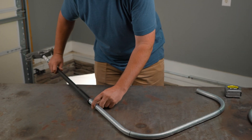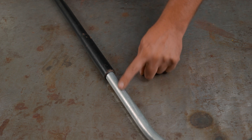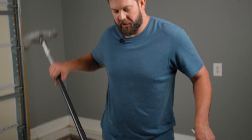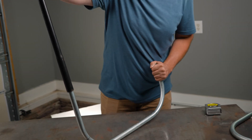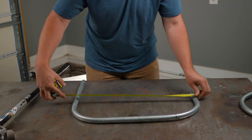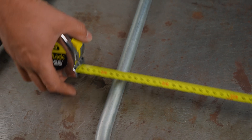One cool trick: I overbent this angle — you can see it's a little bit past 90 degrees. In this bender, and a lot of benders, you've got a really cool trick where you can insert the conduit that you overbent into the handle. You can see it's flared out there to go over the conduit, and then it gives you a long handle to apply leverage and get that back to where you want it. It's really easy to adjust it off, and now we're back to that measurement and really close to that 24 inch distance we want. That's extremely helpful if you're trying to do a table leg or some other U-shaped bend — you're definitely going to want to know that trick.